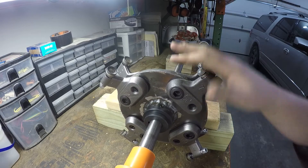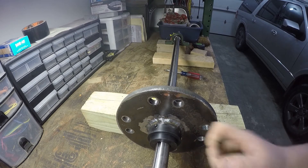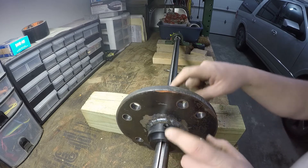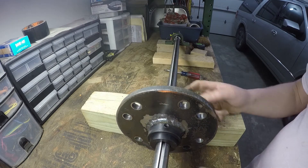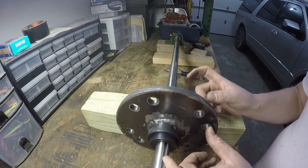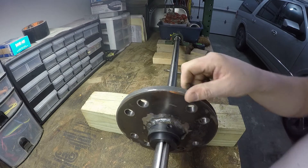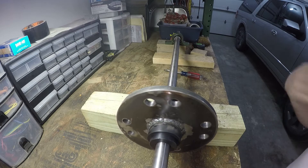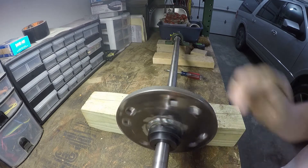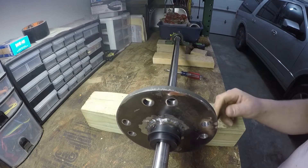I'm going to get these teeth pulled off so we can measure the plate itself. Here it is all stripped down. When I welded these hubs to the plate, I slid a piece of key stock in the shaft — so each of the hubs was keyed to the shaft and I can put a key in from each direction. Obviously there won't be one under the cutting head itself, but the whole thing is three and a half inches wide, so I will have three inches of key in total holding this thing in place. With this thing weighing 20 pounds, that might be too much force, but it does have two grub screws in each side, so that will help hold it.